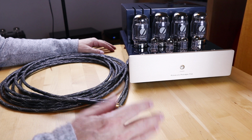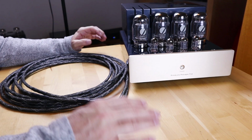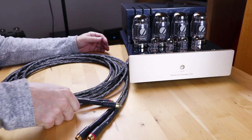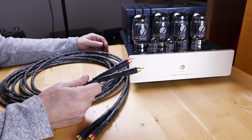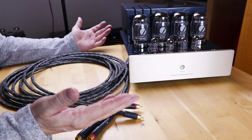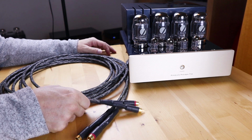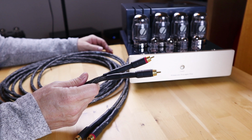What I did was go back to just your amplification and a source, and then start adding things. For me, because I had the amplification and the source close together, I had to disconnect this cable, put in a shorter one, and that solved the problem. So sometimes you are lucky. I could have been looking for something much, much longer.